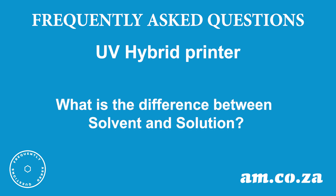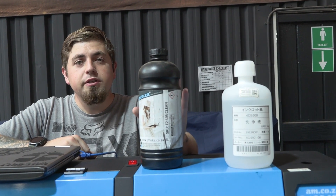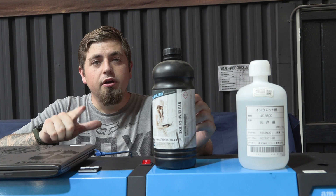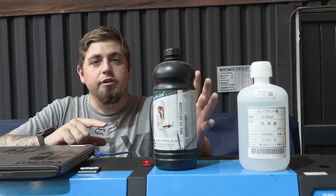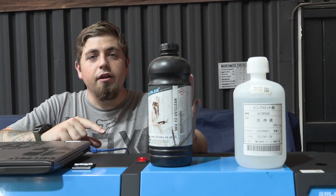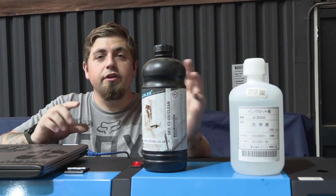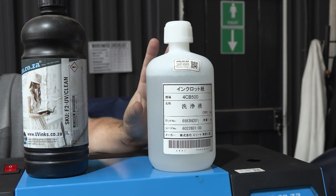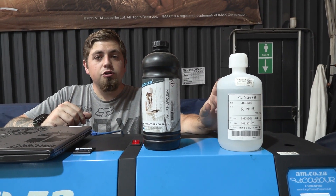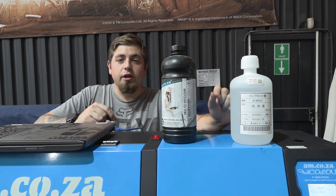What is the difference between solvent and solution? This is solvent, and it's based on the type of ink that we have. You get two different categories: water-based and solvent-based. Because we are talking about our UV ink, this is solvent-based just like our ink. This is used for cleaning purposes only and can eat or damage other parts, so it should not be used long term or left in the capping area. Solution is not used for cleaning — it is purely used in the capping area to make sure the head stays wet so that when you go on holiday or for extended periods of time, the inks do not dry out and damage your head.